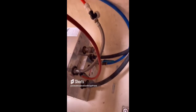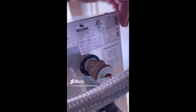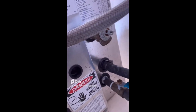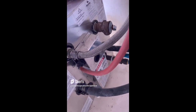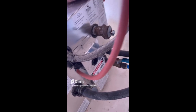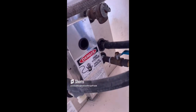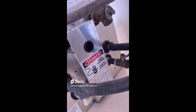For today's find, here's something I often see with regards to water heaters. You see this overpressure relief valve right here — this should be plumbed into the bilge of the boat. The reason is, if it pops open due to overpressurization or overheating, the scalding water would just go down into the bilge rather than spray onto equipment or somebody in that area. You always want to have this valve plumbed either overboard, into a sump, or into the bilge.